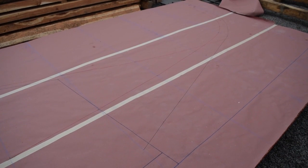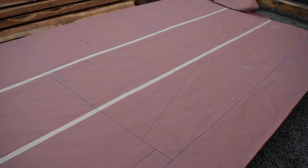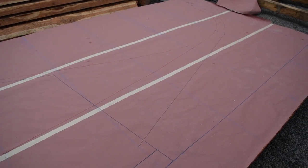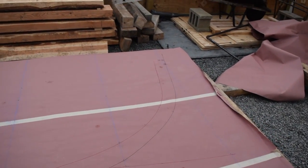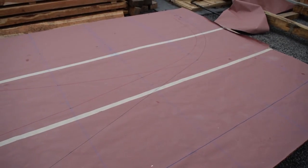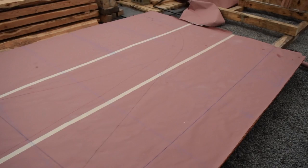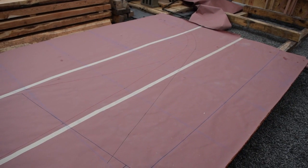We took the time to loft out the bow of the boat as well, using the same lofting floor. You can see the transom end of the loft and now the bow section. The bottom of the bow section is in black and the bottom of the keel and the rabbet are still in red, so you can see where they crisscross in the center — it gives you an idea of the transition and the stem. All these measurements were pulled off our drawings using the construction view, measuring different lines from the waterline and baseline. Taking your time, verifying measurements, and doing things in pencil first before going to marker — it's not that bad.